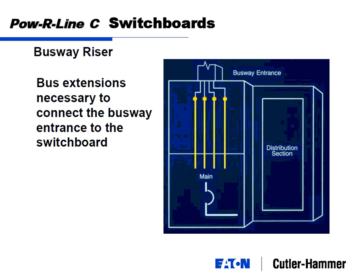So rather than have to come in with 48 cables to get your 4,000 amps, you get 4,000 amp rated busway, which is going to be about this big, bolt that from, say, switchboard number one, back here down to switchboard number two, bolt it to the roof, it bolts directly on it, and then there's a flange that, once it enters right inside the switchboard, it'll spray out or fan out and connect right to the flange connections that are manufactured by the switchboard. Now, busway is A phase insulation, B phase bus bar insulation, C phase insulation. So they're very compact, very quick to install. And look out for more fun with busway next project.